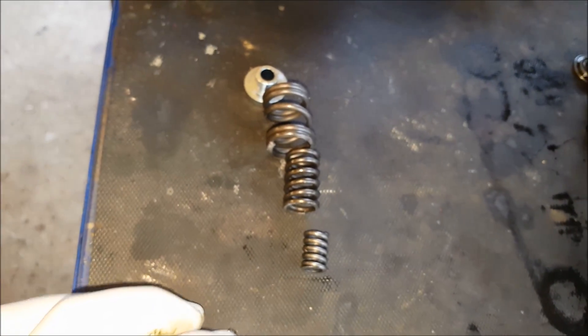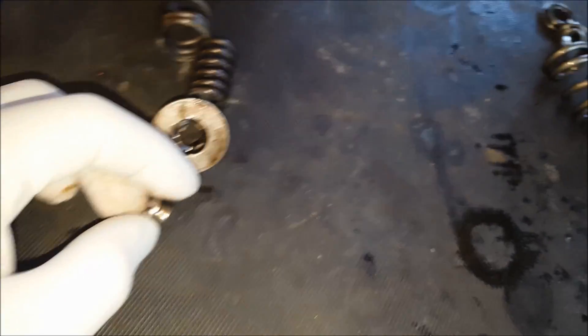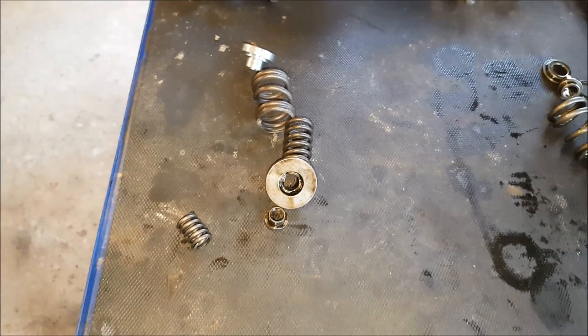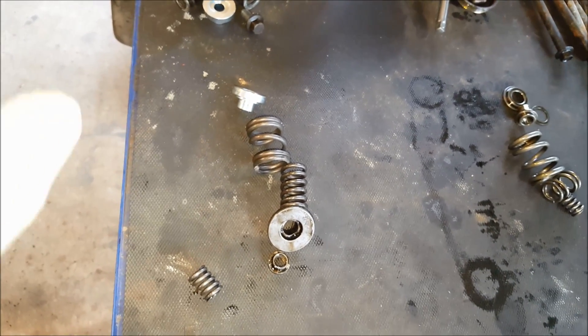If you're doing the 3,000 RPM kit, you get rid of the small inner spring — you're not going to use that. You're going to install the new spring seat and just these two springs, then use the same cap or top retainer. Put that back down in there and screw the nut down to where it was — 50 thousandths in my case. It has a wave lock style to it, that's how it locks in place. Also note there is a fourth spring that goes on the outside inside the pump — leave that alone. There's another shim on the bottom of that and you don't want to mess with it.